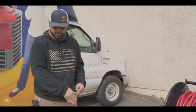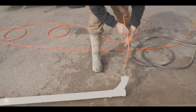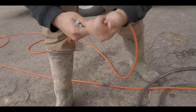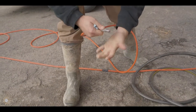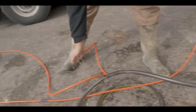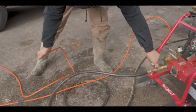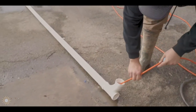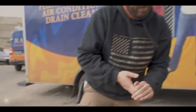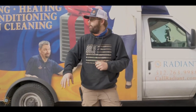Now that we've selected the correct tip and the lines have been purged, turn the water off and retrieve your hose tip. Nicely secure the tip on there - try not to use channel locks or anything abrasive on these because you'll scour the edges and make it hard for the next technician. With the tip on, squeeze it in your hand, turn the water on gently, and make sure all the tip holes are blowing. There's a cleaner in the kit if any holes aren't working. Everything's working - send it back into the drain, turn the water back on, and let it purge a little longer.